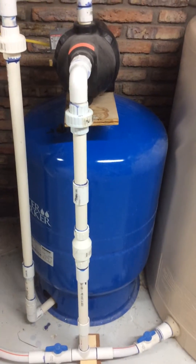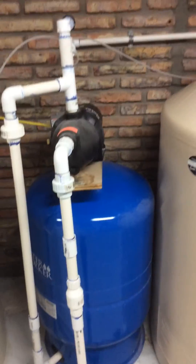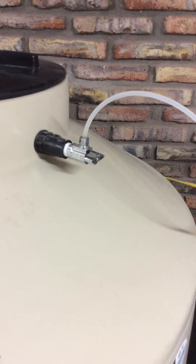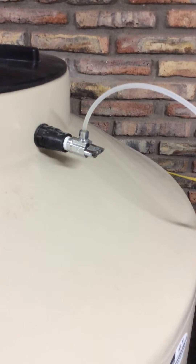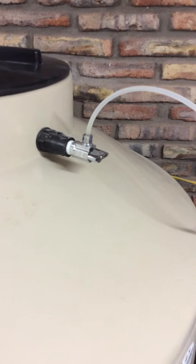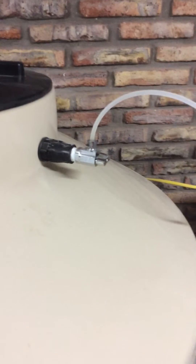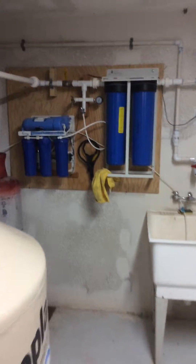Just to make sure nothing goes back into the tank other than clean water. This little check valve right here — there's a sleeve that goes into the tubing and a compression ring on the outside. You need a metal sleeve in there, not a plastic sleeve. That makes the compression ring fit nice and snug so you don't have any leaks on that quarter-turn valve.